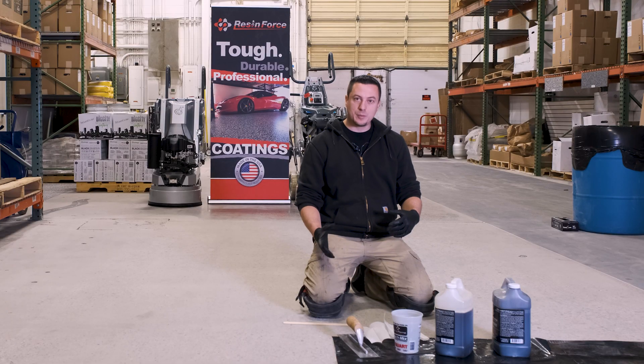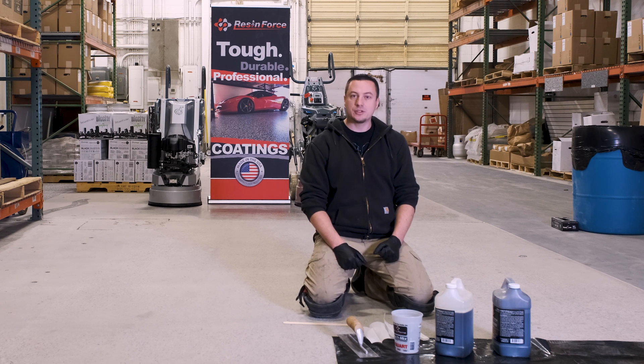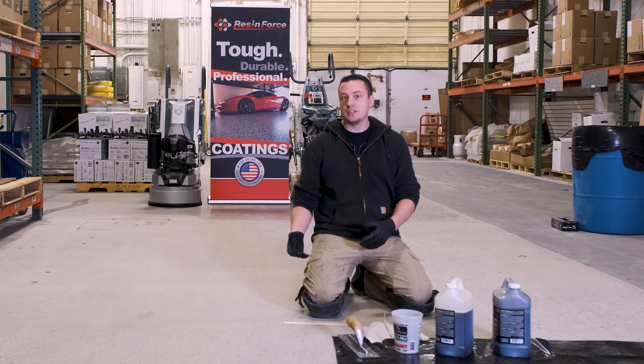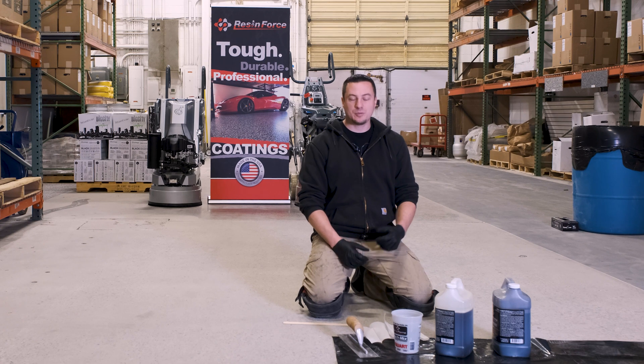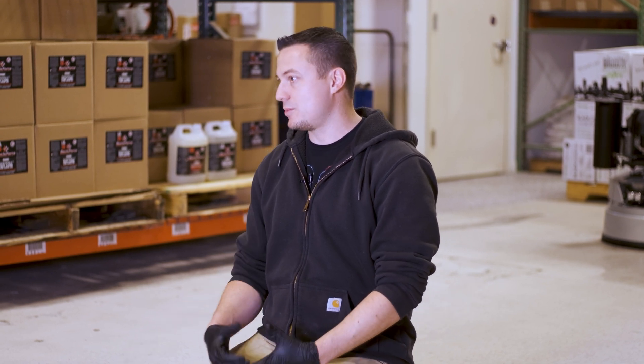Starting off, if you're going to do an epoxy system there may be several different reasons why you would want to grout coat the floor with epoxy, and of course different reasons for polished concrete. We're most commonly using polyurea to grout coat a floor, but there are also urethane systems and 100% solids epoxy. For polished concrete, you may want to use an epoxy with brown or gold mica powder for interesting vein looks over cracks or pitting, but most commonly you grout coat for better gloss and to fill in all the pinholes. For an epoxy floor system, you grout coat to minimize outgassing and lock away the pores.